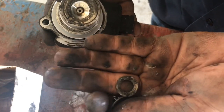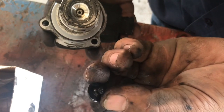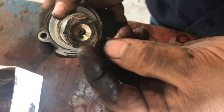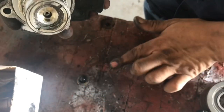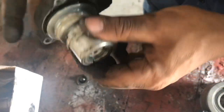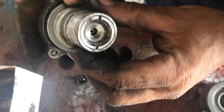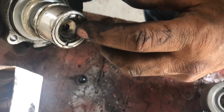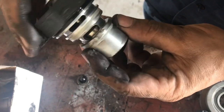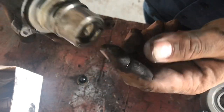This one is very simple. When I took it down, that little washer stayed inside, and this little plunger — which is an actual little valve supposed to keep crap from going back in — it just fell off. So these two little pieces broke off of it. As you can see, there is quite a bit of moisture inside that tank, which tells me this valve was not functioning properly. Air pressure was always escaping. This is supposed to hold and then release a burst of air, which should take some of the water out of that dryer. The plunger still works, but it is leaking air. Let me see if I can take this apart to show you the inside of it.